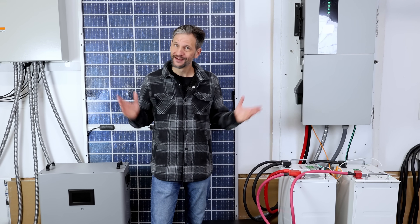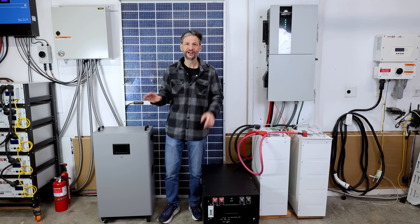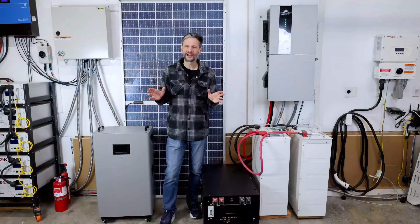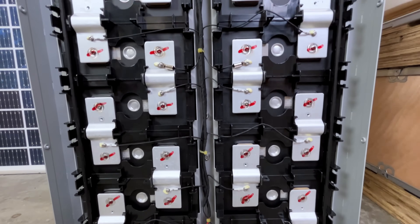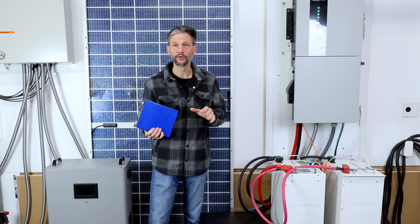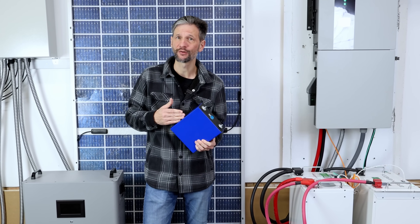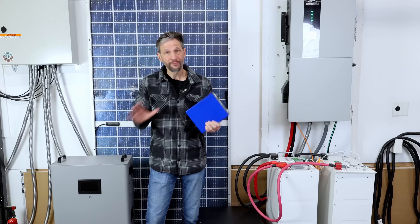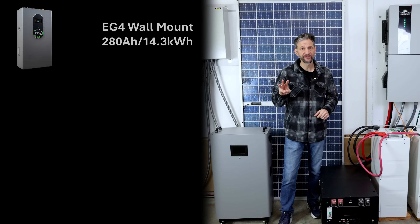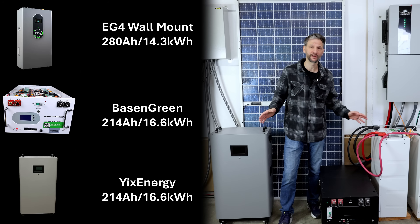Welcome back to Projects with Everyday Dave. There are tons of battery options and I am not covering them all today. For instance, I've tested many server rack batteries and you can still go this route, but I think the best value in today's market is the wall mount or power wall type of form factor. So that will be today's focus. The savings with this style of battery is possible because they use 280 to 314 amp hour cells instead of 100 amp hour cells that the server rack design uses. That dramatically reduces the amount of hardware required to deliver the same capacity. I'm testing three options today because I've tested all of them personally, and it will give you a good idea of the price range and performance you can expect from this style of battery.